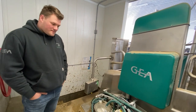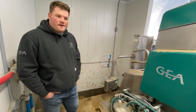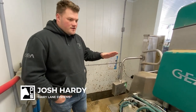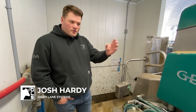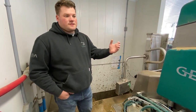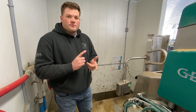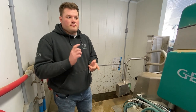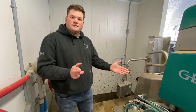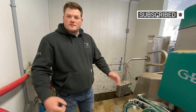Obviously, looking at the robot, can you give me an idea, maybe start with the basics. How is this going to get milk into the tank? So the process we start with is our time of flight camera per quarter. We look for the quarters and remap the udder. And basically we attach, we forestrip, stimulate with pulsation, and clean the teat all at the same time. Then we go to milk flow per quarter, and we base that milk flow on a UV sensor and conductivity to decide, are we going to dump that forestrip milk? We have good quality milk on our UV sensor, and then we switch the good milk to the tank.